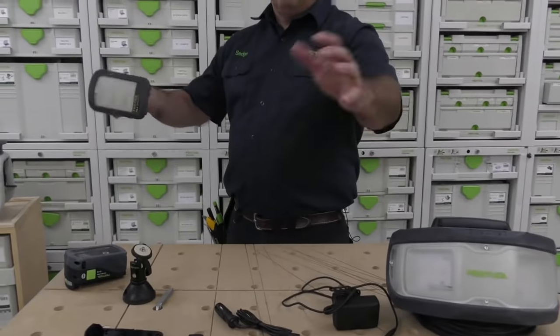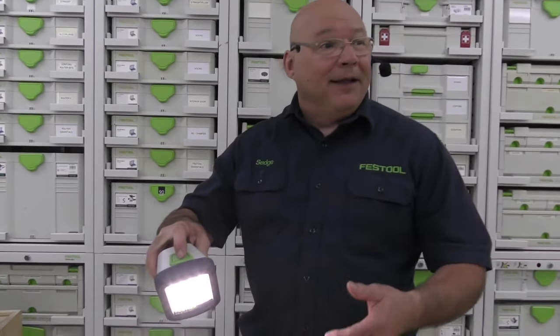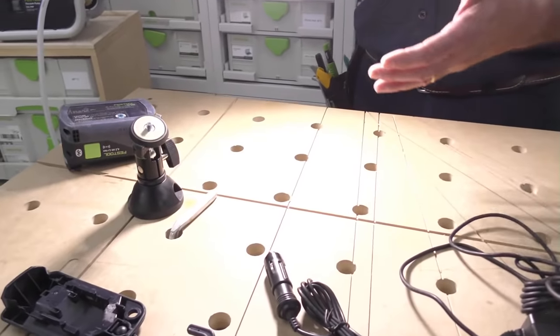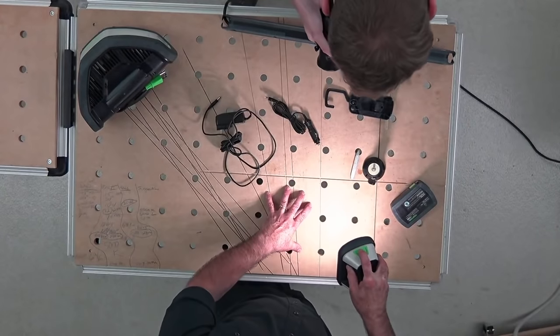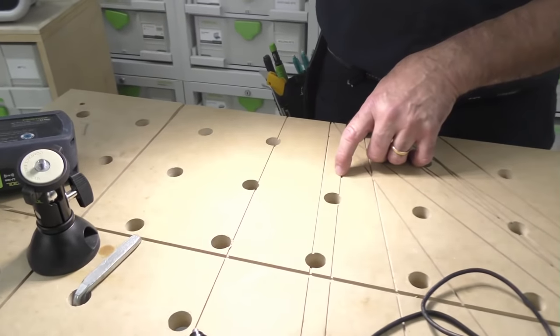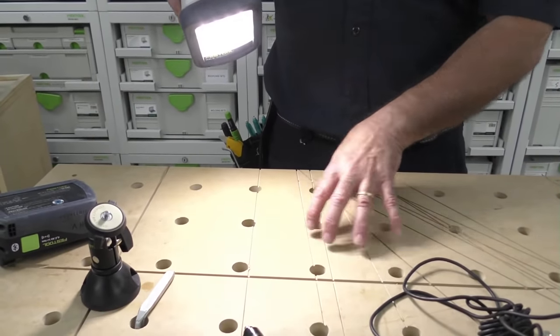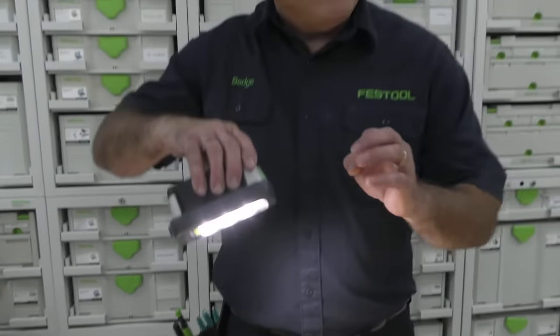This is the newer version — the KAL2, SIS Lite 2, which came out three or four years ago. Everything's basically the same, except there are 12 1.5-watt LEDs. In doing it that way, the 7.2-volt internal battery went from 2.4 to 2.9 amp-hours, so it lasts longer. At 30% brightness you get 290 minutes, and at 100% you get 110 minutes — but look how much brighter it is.